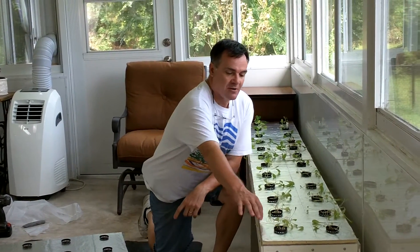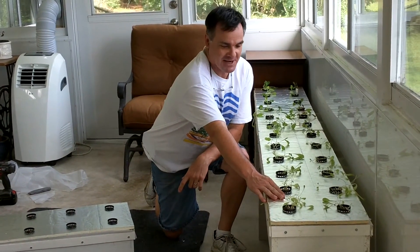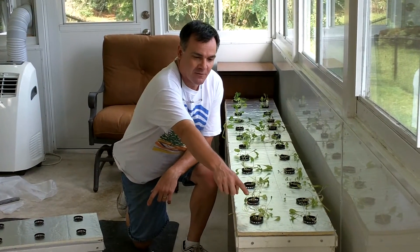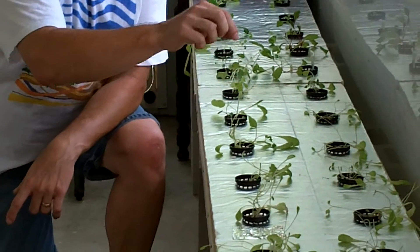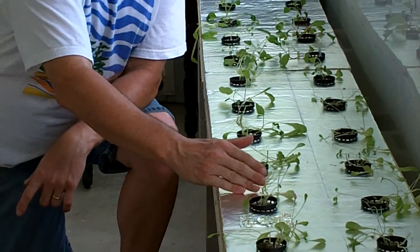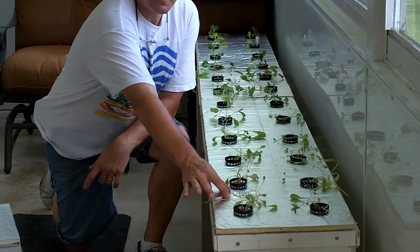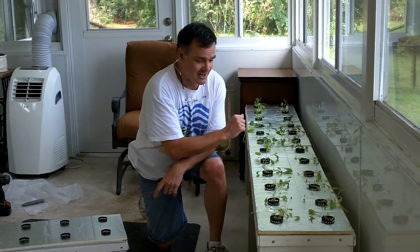One thing I want to point out is if you make a mistake when you're drilling — even we make mistakes sometimes. What you're going to do is save the plugs until you're done cutting your board. I had a little mark here for my line that I was squaring across, but when I was drilling I was going straight through hitting these little marks, and I missed the one to get them evenly spaced. So I just put the plug back in there, used a bit of foil tape, and put a piece on the top and a piece on the bottom. If you don't have foil tape, you can just use duct tape — put it on top and bottom, and that repairs the hole that you mistakenly made.